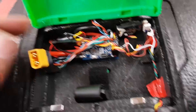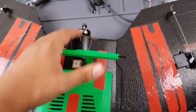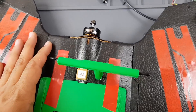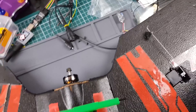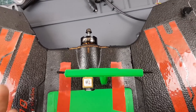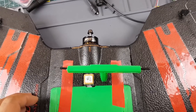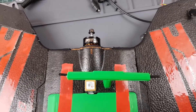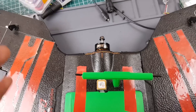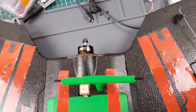Now about the S800 — this is the PNP version, and I had to build everything. Plug and play, basically. The motor that it came with burned on the first maiden, so I had to drive back to the shop and replace it. It came with a 2205 2300kV motor. I also swapped the ESC — they provided a Flycolor 30 amp tiny ESC, but instead I used a 45 amp Sunny Sky R45 Dshot 600. When I tested it, it ran beautifully clean. But maybe the motor couldn't handle that much current, especially on the iNav auto launch which immediately pushes the throttle — I think that's why it burned, or it was just a piece of junk.